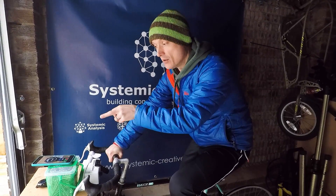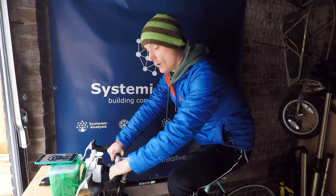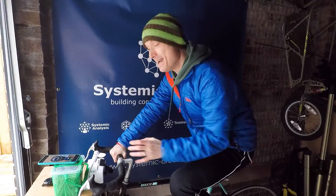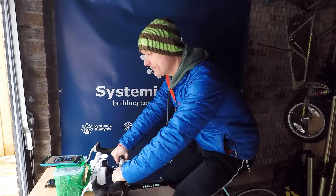Okay, so I'm on, rigged up. The Garmin there is connected to the power meter and we're using the phone to record the power as we record on the Garmin. I'm just going to pedal — there's no electrical load on the circuit whatsoever, so I'm literally just turning the alternator and the mechanism mechanically. We're looking for 63 watts — here we go.